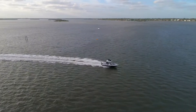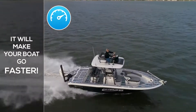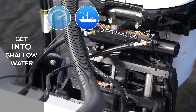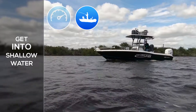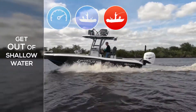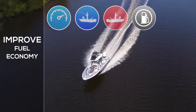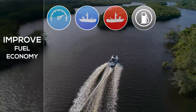A jack plate will lift your engine and position your propeller closer to the waterline. This removes much of the lower unit from the water to reduce drag and increase the speed of your boat. With your engine up and your propeller closer to the waterline, you can safely get into and navigate shallow water. With a jack plate you can safely lift your propeller away from the bottom to get up on plane in shallow water. Lifting the engine with a jack plate reduces drag and moves the propeller further away from the transom to avoid the boat's turbulence as it travels through the water.